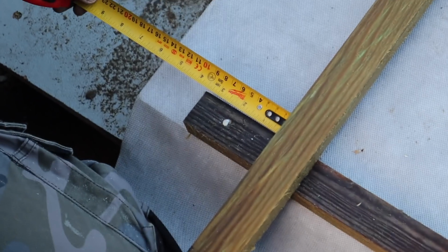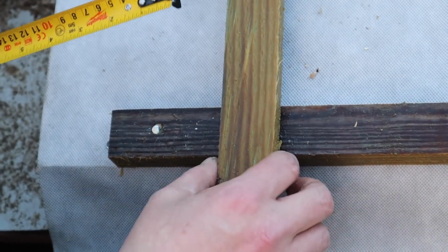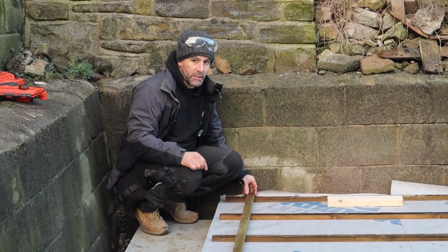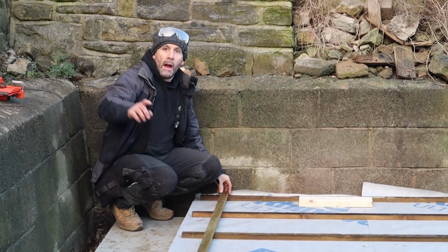off the bottom of the OSB. You done that, yeah? How far over that bit? I'll get it flush at this end. Right, so he's measured 6 inches up. What we're going to do now, are you good, yeah? So he's going to use 90mm nails. He's going to nail through there. Adam, jump over here with the nail gun, will you? Adam's going to jump on this Milwaukee nail gun.